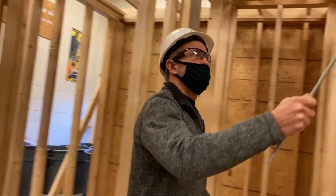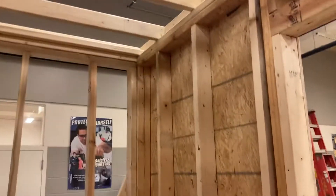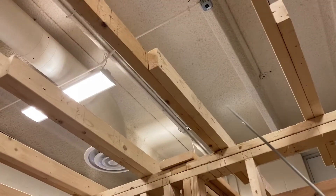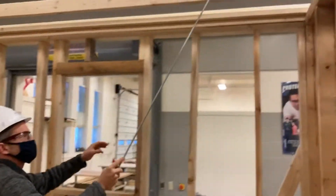After they finished that, they finished up their ceiling joists here. If you look at our ceiling joists, this is clear span here in this part of the room. The ceiling joists rest from the double top plate all the way over and sit on this double top plate. Where it intersects the bearing wall, we're allowed to splice our ceiling joists so we can use shorter ones. We spliced them and had to do our layouts — it was a little tricky so we could get these placed in the right spot. The ceiling joists were set 16 inches on center all the way down the house.